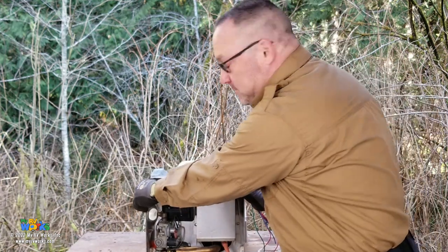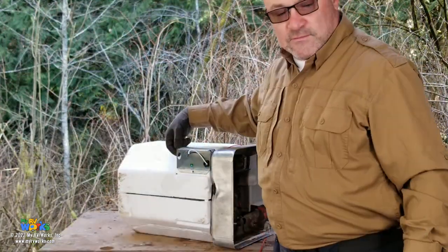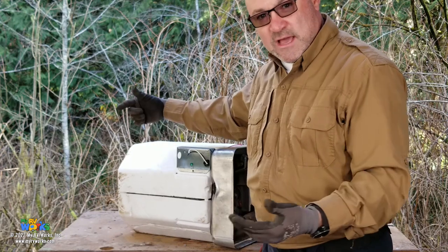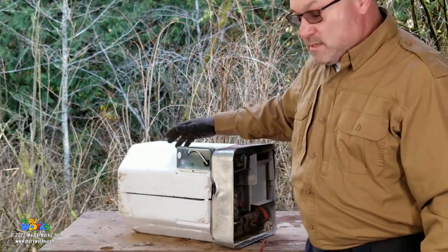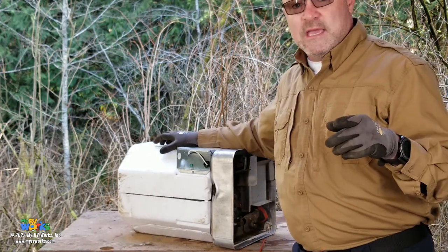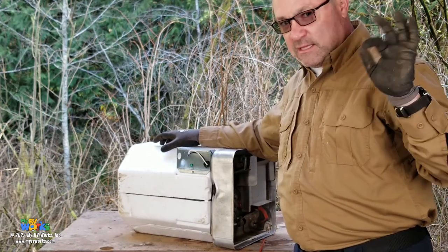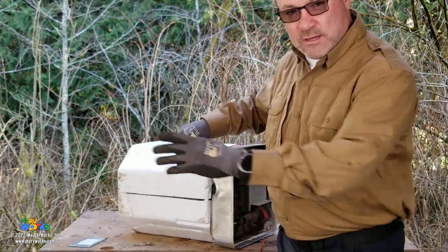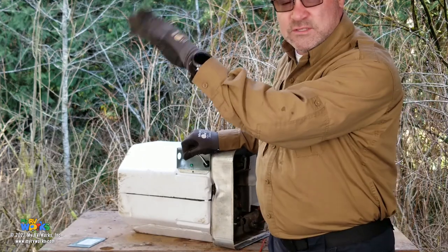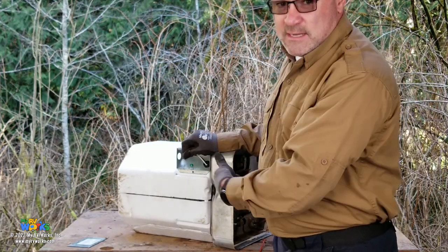So if your AC, here we have a junction box. From your breaker box, you're gonna have a piece of Romex wire that feeds into this port right here. Now, some of you may have a convenience receptacle in your RV, and it might look like a light switch. So Romex is gonna come through here, whether it comes directly from the breaker panel or comes through the breaker panel to the convenience switch, which will look like a light switch, and then down to here.